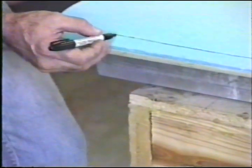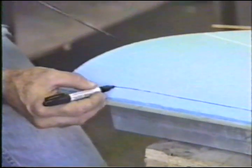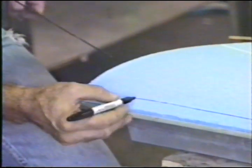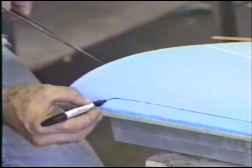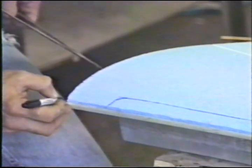Now down at this portion of the wing, we're going to end up cutting this section off when we get ready to do our winglet installation. So before we get within 3 inches of this bottom section, we swing it forward and right to the center line leading edge. And then we run our cable from here down this direction.